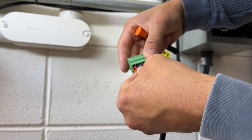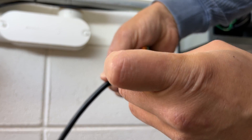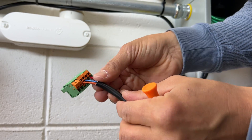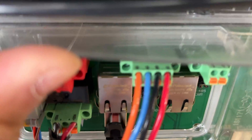This is the cable for communication between the Tesla Backup Switch and the Powerwalls. On the side of the Backup Switch we don't need to remove insulation from the wires — we just insert them into the connector and close it, and the connector bites into the wires. On the Tesla side we have to remove insulation and insert into the connector there.